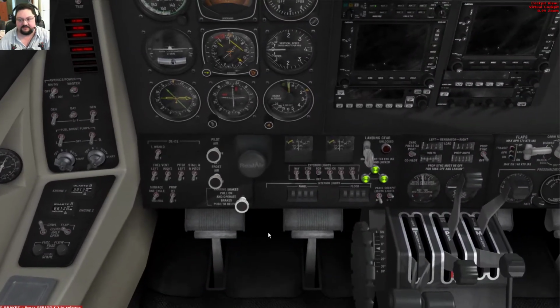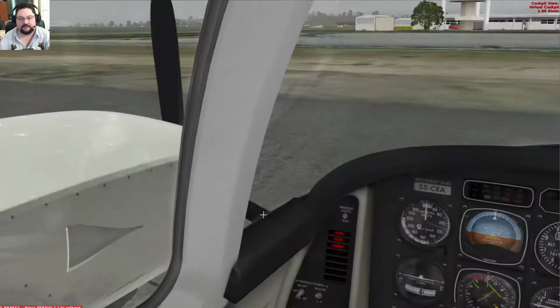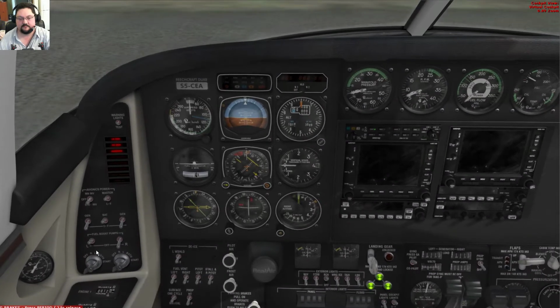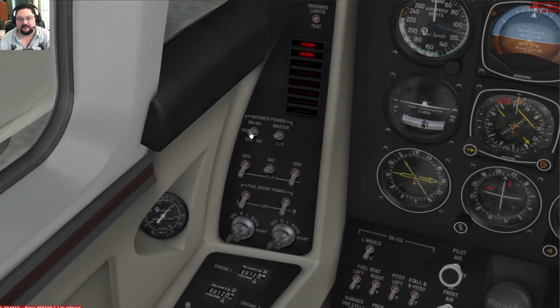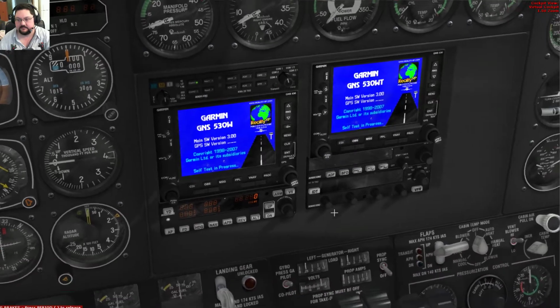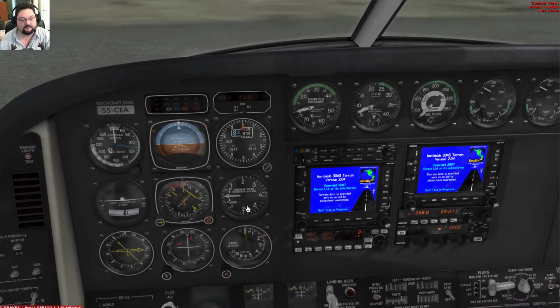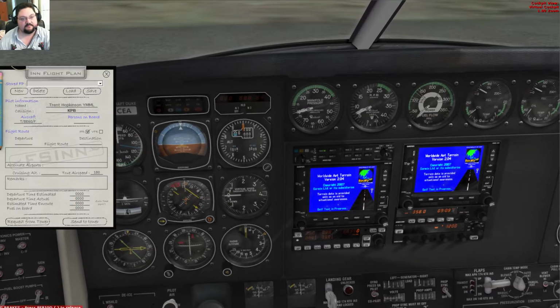Okay, I'll do the same with the left engine. No one's out there, prop is clear. Pump is off. Okay, avionics inverter set to the main one. Generator's on and the boost pumps are off. Let's get some power on this GPS unit. While we're down there, we'll probably need to have a look at chucking out a flight plan to the guys.